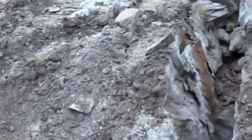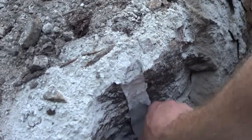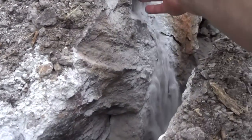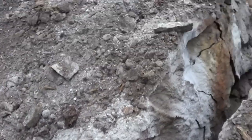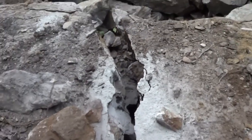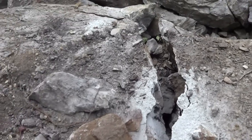You can see right here — there's one of the drill holes. Look at that — the EcoBust just turns to powder afterwards. Twenty-thousand pounds per square inch of this stuff, and look at it, it's just powder now. Busted that rock right in half. Cool stuff. That was a pretty big rock — several feet thick, at least three feet thick. We're gonna go down and take a look at the other rock.